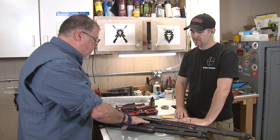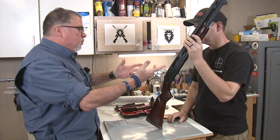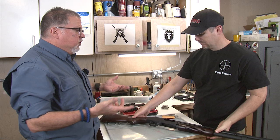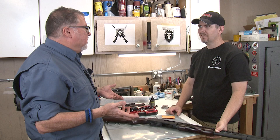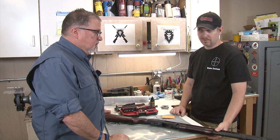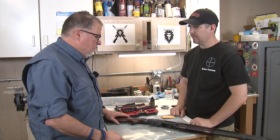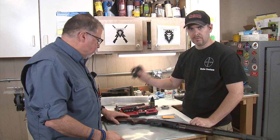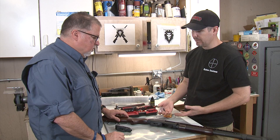Let's go ahead and do something. We'll make some more room and put the A1 away, then go ahead and replace those two parts. We're not going to replace the barrel — we'll keep the barrel as is, because the thickness difference won't matter to a typical user, but if you're in a military unit that uses a shotgun a lot, the heavier barrel is going to make a difference. We have our new aluminum trigger guard and our new aluminum safety switch and replacement screw. We'll pull the trigger guard out, replace the safety switch, and then install the trigger guard.